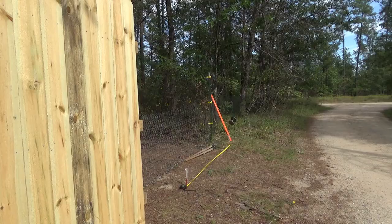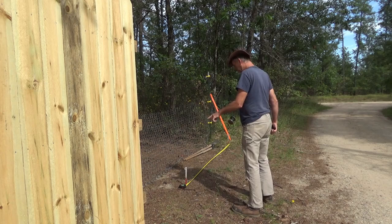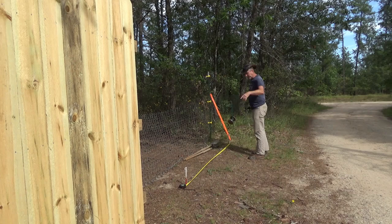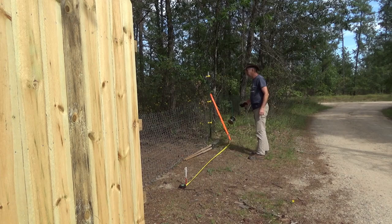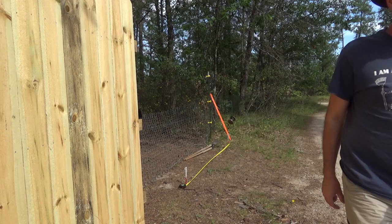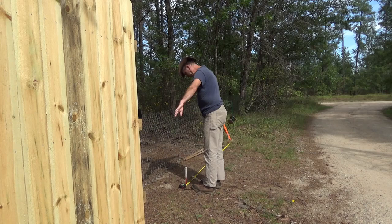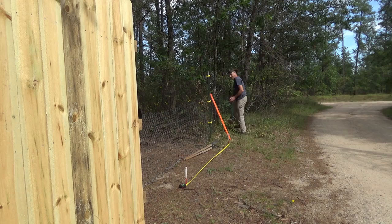So what I have is I'm going to come out 5 feet more with boards, with pickets, and then I've got a 10-foot gateway, so 2 5-foot doors, and then I've got to get some more posts. I'm going to go on past the garage. As I said, I'm going to try to get the permit to go on all the way around with sawmill slabs. So I've lined this up as well as I could with the driveway. Try to make this straight, this driveway.